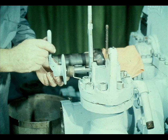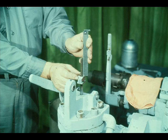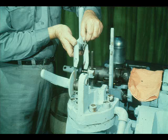The auxiliary resetting lever is next to be reinstalled. Slide it into its bracket with the return spring. The locking devices must then be installed to hold the auxiliary resetting lever in place. The valve stem connection block should be screwed onto the stem and returned to its original position. Check the position by measuring and compare it against the measurement taken earlier during disassembly. Now insert the guide blocks into the resetting lever and hold them in place with your hand — if you don't, they may fall out as you install the resetting lever.